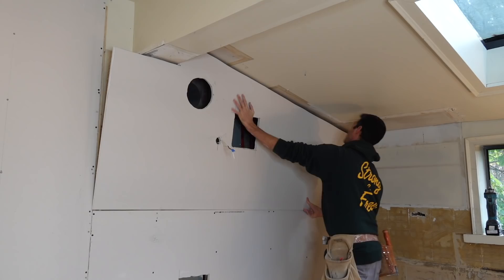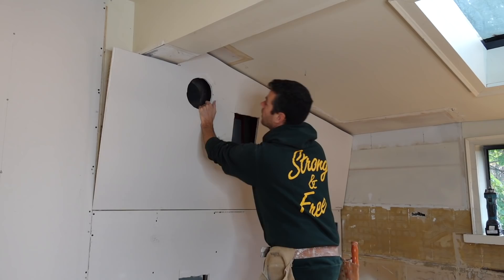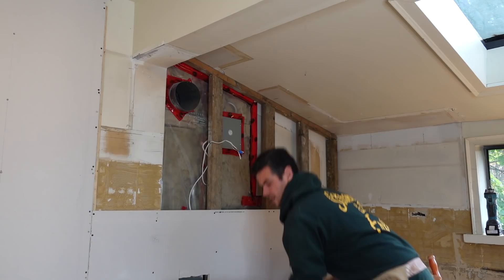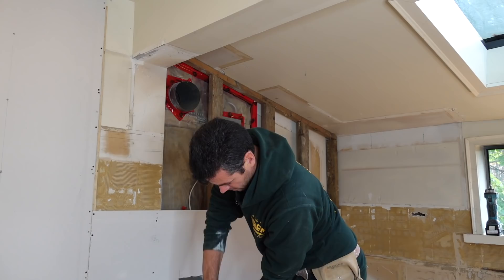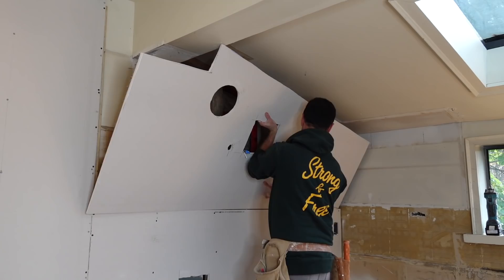We're tight in this corner and in this corner. What are we gonna do about that? Take it down and rasp it - that's what we're gonna do. It's mostly this corner. Try that again, and for the heck of it I'm gonna back-bevel this top piece a little so I can carve it a bit - should help.